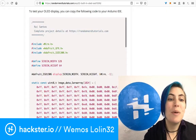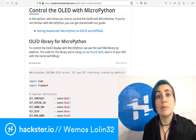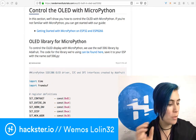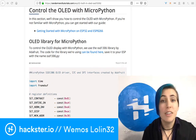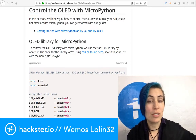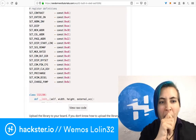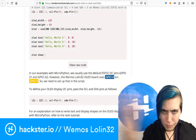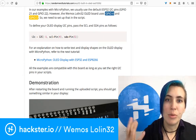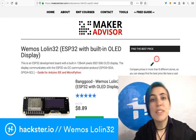There's also a section about how to use MicroPython with it, and I think MicroPython is the future for most microcontrollers. It enables you to store your code right on the board and run it without having to compile, which means you can usually just find your code file on the board in a legible format, open it in a text editor, save it, and it'll run straight away rather than having to compile and upload every time. This is the OLED library for MicroPython, and again you'll need to modify the default I2C pins — in this case GPIO 4 and 5.